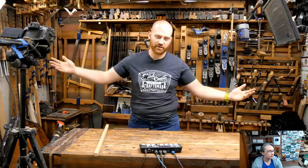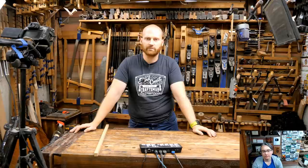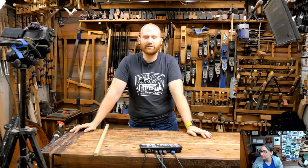And so that's why you generally want to do your cutting your joinery and assembly in one day, unless you can guarantee it. Which is one of the things I love about being in an air-conditioned basement. I can do the joinery on one day and come back a month later, and it's the exact same size. It just doesn't change. So it's very nice that way. But stickers, let air flow. Best ways to manage your lumber so it doesn't change too much. Good question. And I'll probably be doing a couple videos on that here in the future.